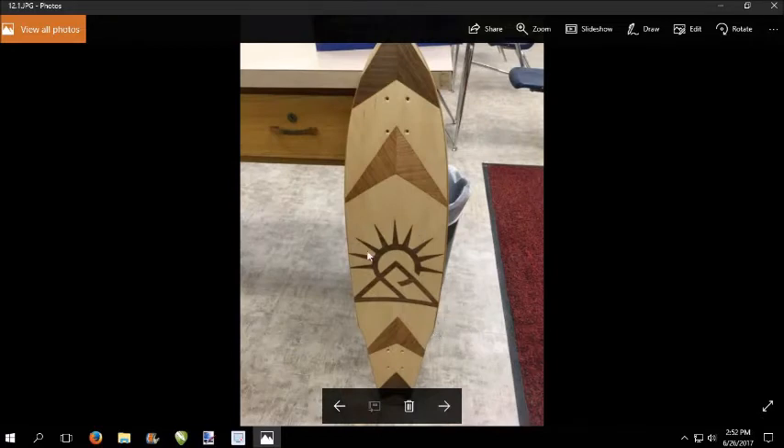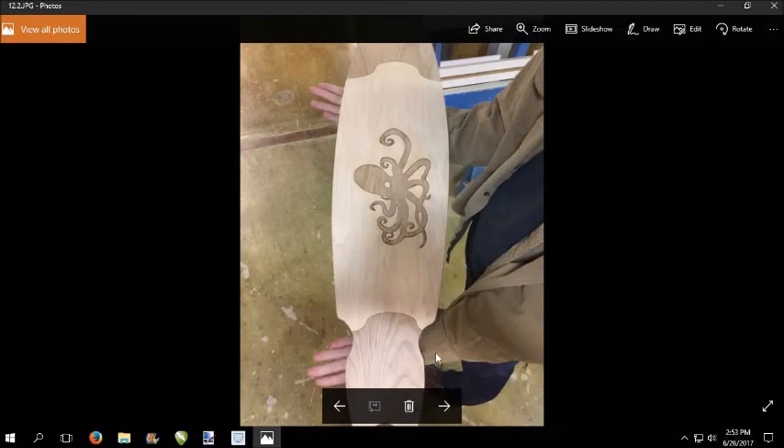Not all your transitions have to be completely straight. Here's a straight transition that was cut on a saw. This one was cut on a chop saw — he cut the angle, and then cut this out on the laser engraver to fit that angle. That's tricky to fit, but it can be done. He just pieced it all together, and once those cuts were made, everything else fit in the laser engraver. Here's another example where the transition doesn't need to be straight — he did waves. He cut the middle out at 24 inches, then cut the waves on each end, then cut out his image in the middle, and pieced in the same wave shape on both ends. Your transitions don't have to be straight if you don't want them to be.